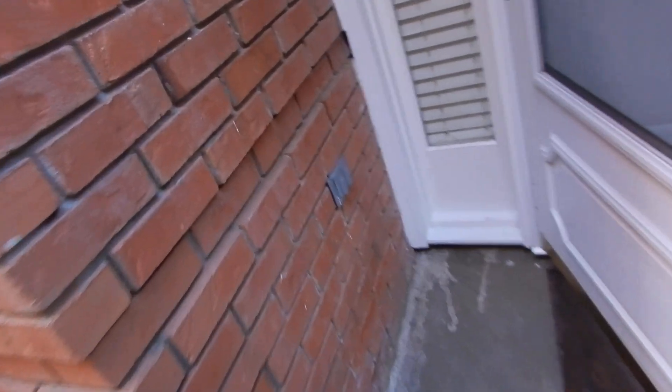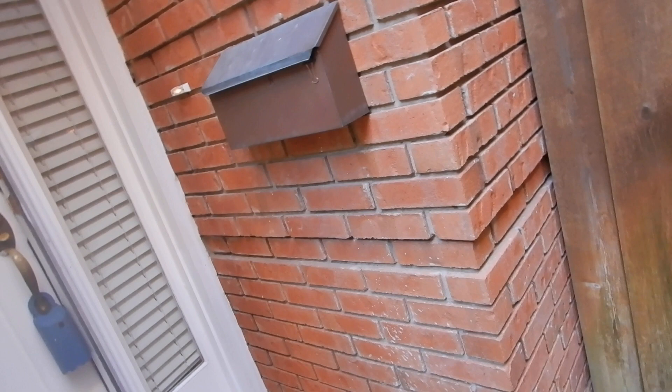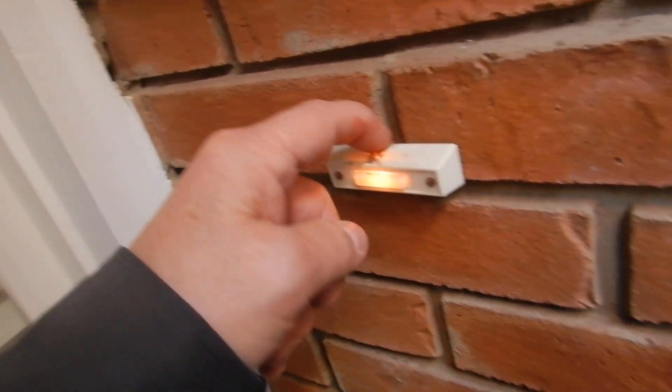The little fountain works and the GFCI works, but the plug for these lights — these lights plug in — you shouldn't have an extension cord running to your exterior lights. These lights have been decommissioned. We've also got some missing mortar underneath the stretcher bricks at the front door. The front doorbell should have been sealed. These were bootlegged on with extension cords, and the plug is all rusted up.